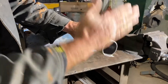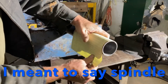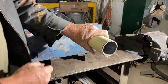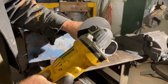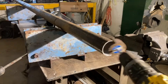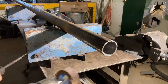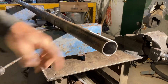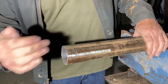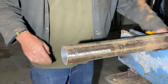The very first thing you want to do is make sure you've got a nice square face to slide that hub into. What I like to do is just wrap a piece of paper around, make sure the edge is perfectly aligned — usually if you do that it's going to be pretty close. Then just take a cutoff wheel and slice it off. Once that is done, I just took a flapper disc and ran it inside to clean up and make sure there was no debris that was going to stop it from sliding in. The next thing is to cut a little bevel so that when we weld we can get good penetration and a nice full weld all the way around.